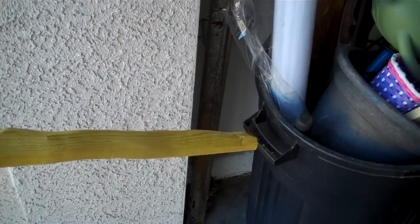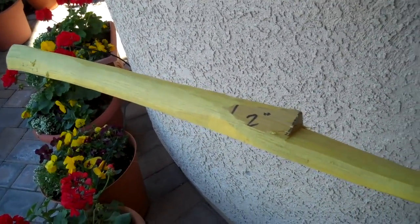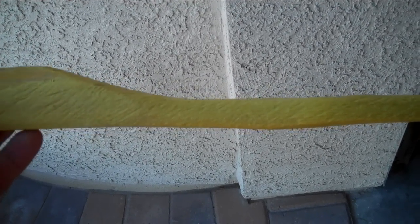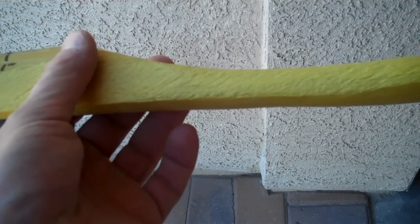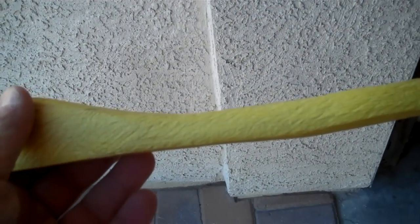Here's a pan out showing the dimensions. I still have to do the fades on this side. You can see how right at that terminal end it can be a little bit thicker - or rather thinner - than over here. The next step after this is to start reducing the bow to floor-tillered dimensions, getting the limbs bending a little bit, and once we start doing that we tiller and finish. Hopefully everything will work out - Mike from Boyer Bows, see you soon.